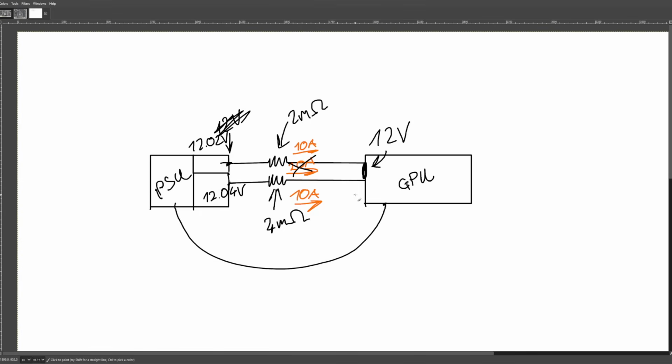I've never seen an AMD GPU bother with this. Really old NVIDIA cards didn't do this. I do actually know why they do that. It's because their power monitoring and power limiting is overly sensitive. Instead of giving their power limit a little bit of headroom to work with, they went the complete opposite direction, where the power limit is extremely strict. And so you need a bunch of active current balancing circuitry so that the GPU doesn't bounce off of its own power limit. And it's like, why?